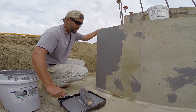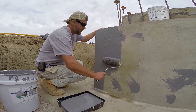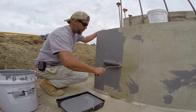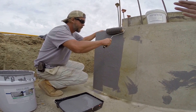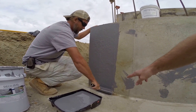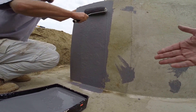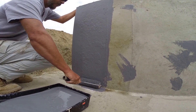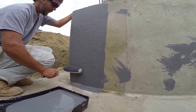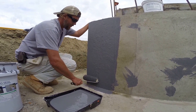There's really no odor to it — it has a little bit of a sweet smell, actually. The nap roller will hold the product on the wall. You want to put it above grade and below grade. This is going to be completely backfilled. The footer joint is important — you want to get as much material in that footer joint as possible. That's probably going to be hard with a roller, so I advise Josh to get a masonry brush and just fill that whole footer joint in. That's probably the weakest part of the whole concrete wall, so they'll get that footer joint capped with our Deco Seal.